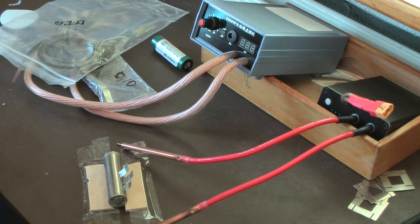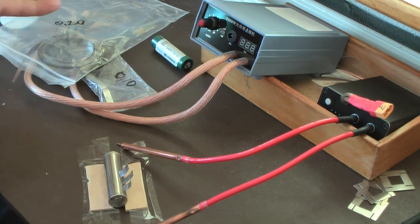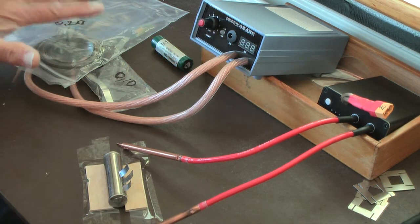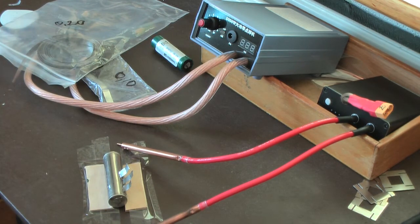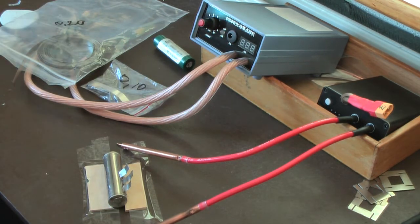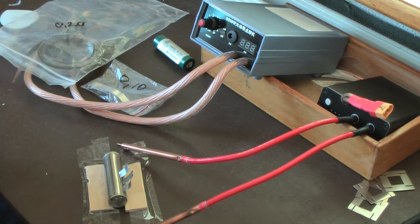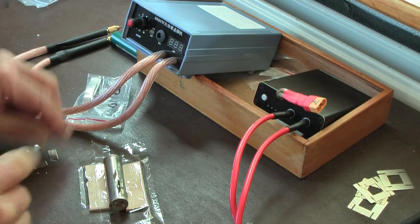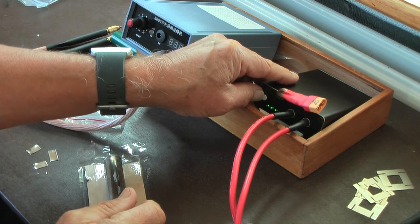It's one day later now. Since I was in doubt about the exact thicknesses of my nickel strips, I tested them to confirm they were pure nickel or nickel-plated — these are all pure nickel. With a micrometer I've been able to determine the exact thickness of my pure nickel strips: 0.10, 0.10, 0.15, and 0.20 — so I can test them all. Since I already tested 0.10 with the mini welder, I'll proceed with 0.15, in 4th gear.